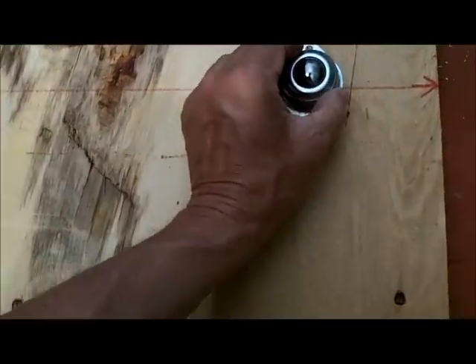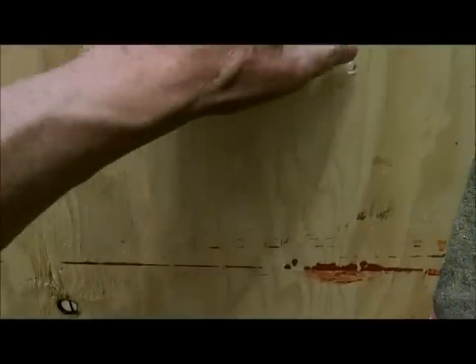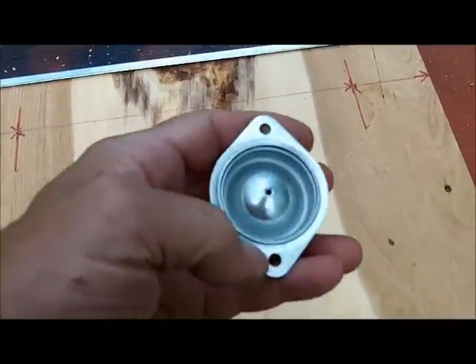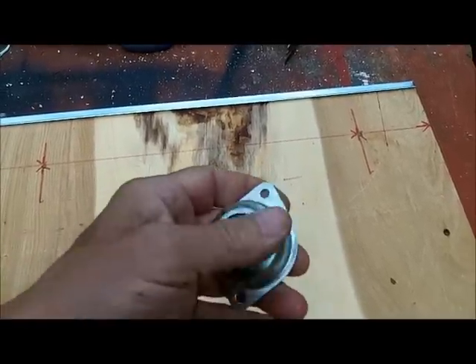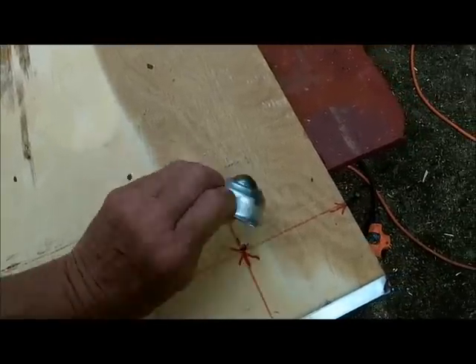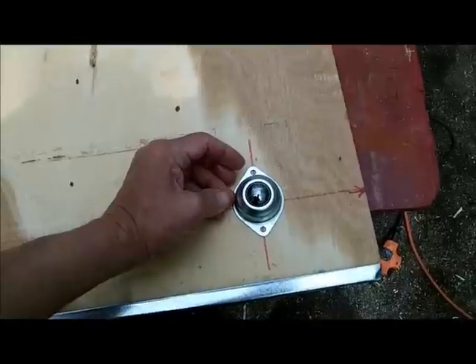Each roller is going to be mounted like this. You're probably wondering what the holes are — this is the top of the board and you need a way to oil these periodically. There's a little oil hole right here. I put some three-in-one oil in there. When it's mounted on the board this way, you stick your three-in-one oil can in from the top — you don't have to take them off or move the generator. It's called thinking ahead.